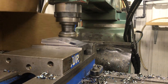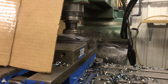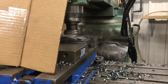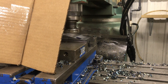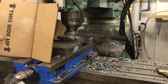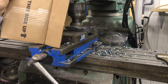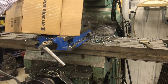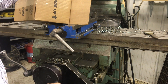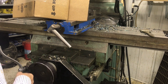The RPM and the feed rate is critical. I'll have to talk pretty loud now because this is pretty noisy. Once it gets into that cut, man, it just buzzes right along. Those inserts are octagon shaped so I get eight cutting edges out of them. If I happened to turn the spindle on backwards I'd break them all and they'd be shot. We're going right through it here. I've got to keep those chips from flying — they are hot as a pistol. You can hear it's a nice steady load on the cutter. You've got to have some horsepower to do a cut like this.